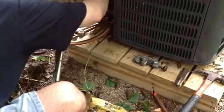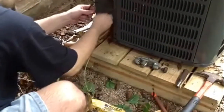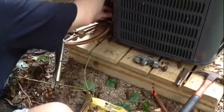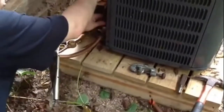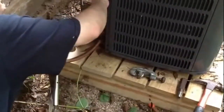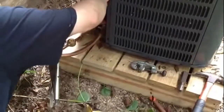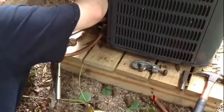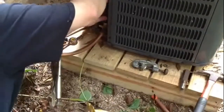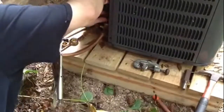I'll open these up all the way. Now we've got a little bit of nitrogen in the pipes to help pressurize it and keep moisture out. It's in the unit, so you might as well take advantage of it. Everything's open — the main valve is open. I can't stress enough: you've got to get the nitrogen out, because that's not R22 anymore. They used to come pre-charged, but now that's against the law.